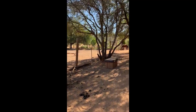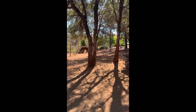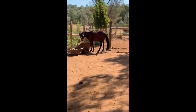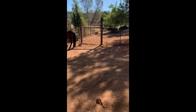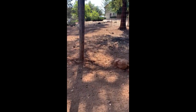Okay, so why go down 2 feet? I said before, I'm anal about getting down 2 feet exactly for my posts. Number one, a common depth makes your fence line more even, which isn't that big of a deal. The more important reason is these big fellows right there, 1,000-pound horses running around, and this ground gets wet. The first thing horses are going to do is eat your ground bare. So they took away all the grass cover, and then they start walking along the fence line, and you start getting erosion on your fence posts.